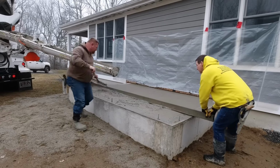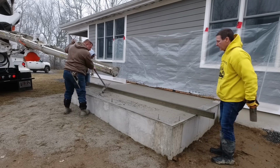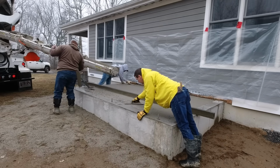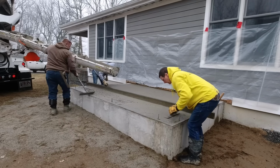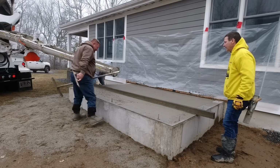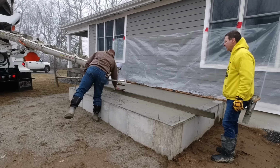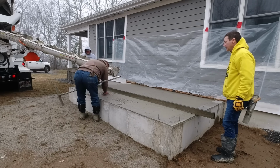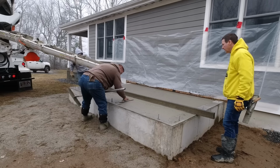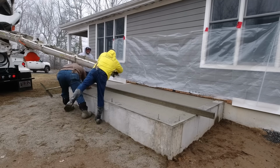Now, if you look at the way we screed this thing, we go right off the top of the wall, but we keep the screed tipped on the back edge a little bit. We don't saw it back and forth. We don't keep it flat like it's sitting right now and just cut the top of the concrete off. We tip it on the back edge, and what the pros know that the amateurs don't is that it seals up the surface a little bit behind the screed. So it's going to make bull floating a lot easier, and we're not ripping and tearing the surface. By that I mean that front edge isn't digging into the concrete and ripping the rocks. There's 3/4 inch size rocks in there, and those rocks will just tear open the surface and leave big holes for you to fill in.